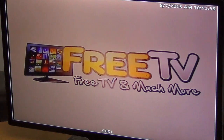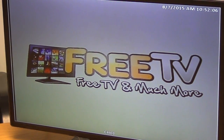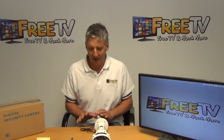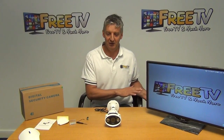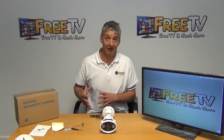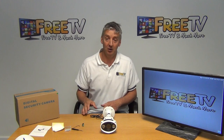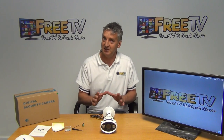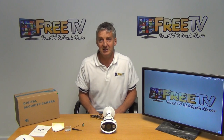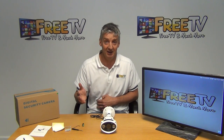I'll just knock the lights back on. A typical application for a camera like this would be covering something like a driveway, because you have the length and the ability to focus in on a specific area — particularly if you're trying to pick up a car coming in. Within our range of cameras, we have standard definition 960H which are still very popular. The coming thing is AHD — analog high definition — which has a higher picture resolution but hasn't quite the range of cameras yet, and the price point is considerably higher. Something like this though is very good, and we often use cameras like this for our own setups. So that's an overview of the 50 meter 960H bullet camera.